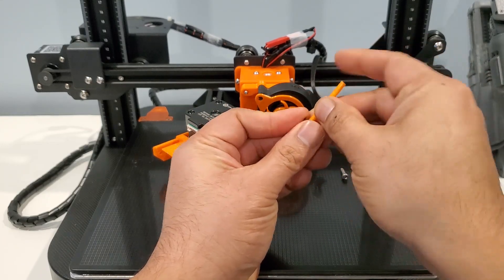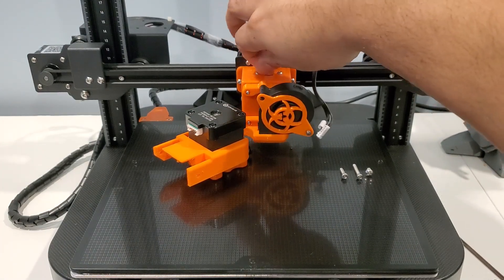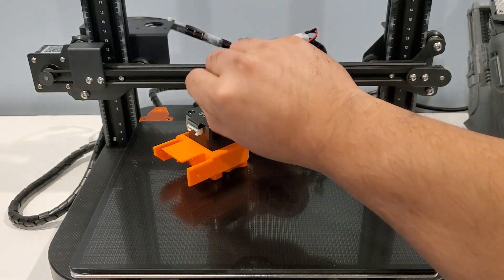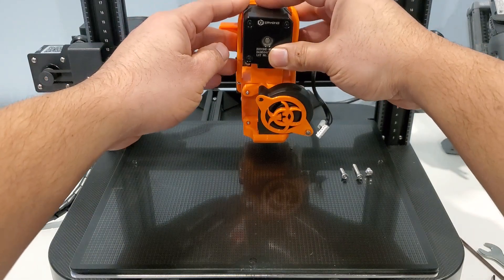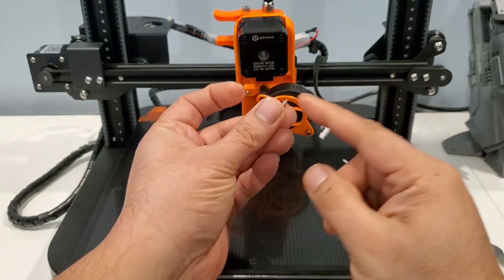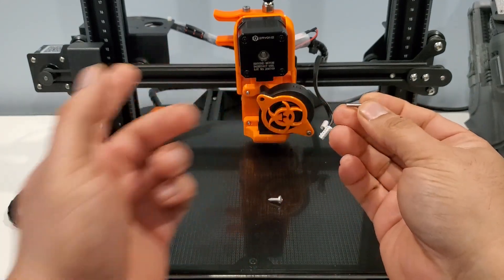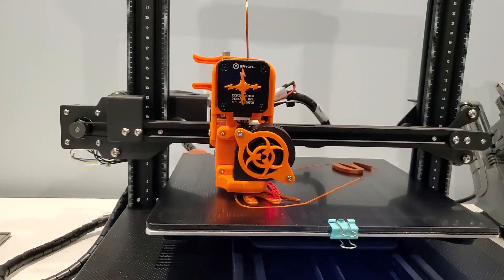Screw it in, leave one twist, push it all inside, and then you can tie it — not too much, make sure it's secure. Put the extruder motor on top like this. I'm using the same screw that came with the fan on the side; the screw will go over there. This is an M3 screw just temporary — you can use M4 and that will snug fit inside.